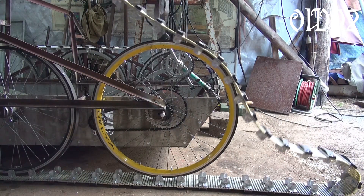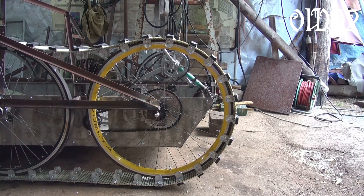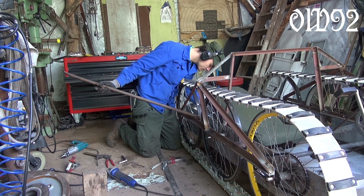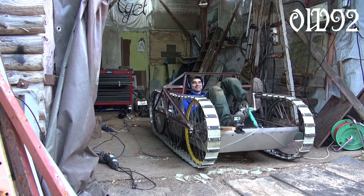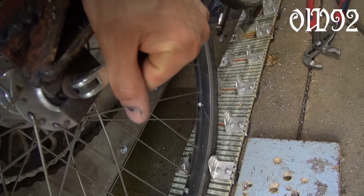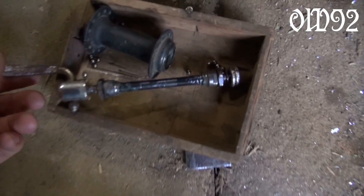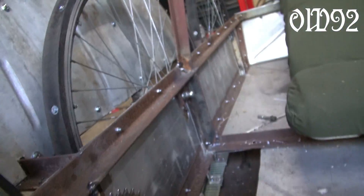Now it's time to put a track around its wheels. I didn't waste any space or material on a bolt-in track tensioning device — I have to do that manually with a crowbar. Joy was just for a short time because after a few meters I noticed the tracks already got loose, because three wheels had wheel hubs with nuts and three wheels had wheel hubs with quick spanners. Those spanner hubs are just scrap, impossible to keep them tight. Luckily I was able to change the wheel axle bolt itself, and after that I could give the tracks the needed tension without any more loosening, because the nuts are more reliable.